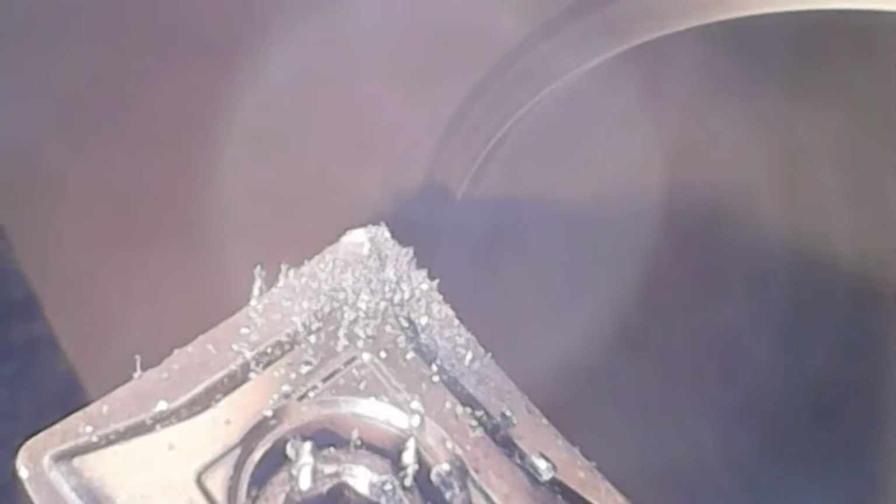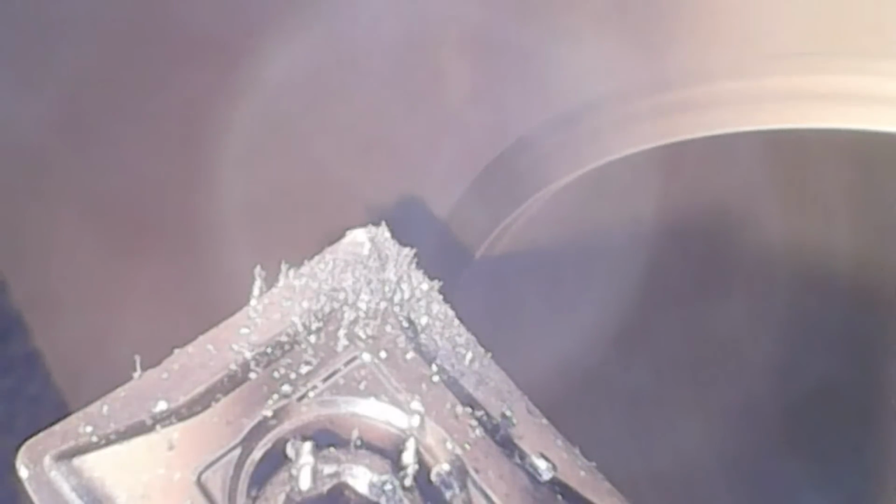All right, let's go ahead and touch off so we can touch our face. Got 0. All right. Within a couple thousandths, you know, if you're removing material, it's not 0. All right, now we're going to come in on the bore and touch. And we can set 0 there. Now we'll do the same thing we did on the outside, and we're going to take 100 thousandths with this insert. And we're only going to run it and watch the close-up camera until I have to yank it off of the lathe here when we get to that spot. All right, here we go.